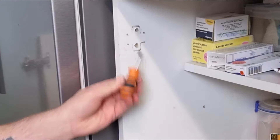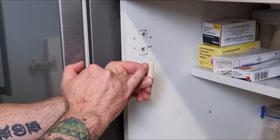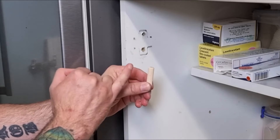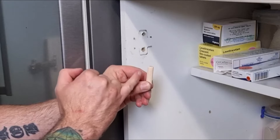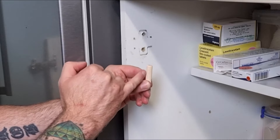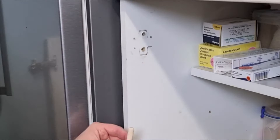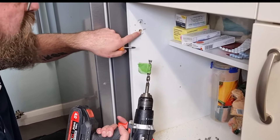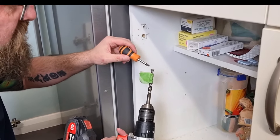So what we're going to do is use the 10mm drill bit. We'll put a bit of tape on here about 10 to 12 millimeters in so we don't go too deep through into our fridge, and we're going to drill that hole out. Then we're going to insert a 10mm dowel into there and put some super glue on it so it dries quickly — but you could use PVA glue if you wanted to. Dowels are great because they're made out of solid beech, so that's going to give us a really good strong fixing for our screw to go into the cabinet.